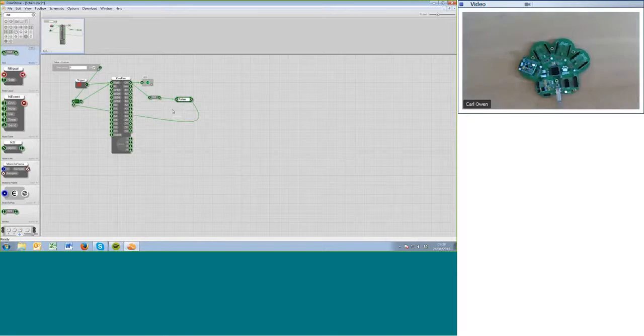How can one control devices with FlowPaw that use 24 volt, 230 volt, or 380 volt input? Okay, so the relay that comes with the FlowPaw actually works up to 240 volts, so you can actually switch mains electricity. If you're going to control higher currents, then you need to connect it to some other kind of high current relay. So you could actually slave off this relay and connect to a relay that switches on a power station if you wanted. So the main thing is to use the relay as a starting point, and then you can connect other devices which are capable of handling more current to that.